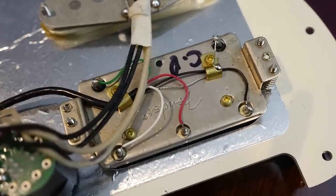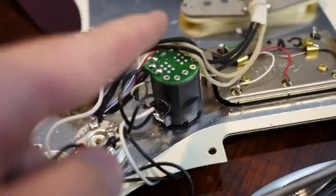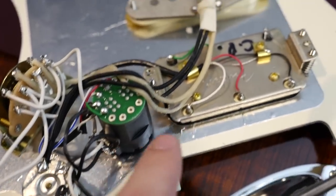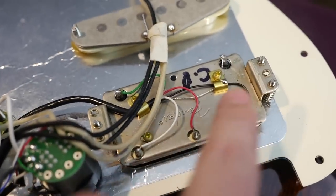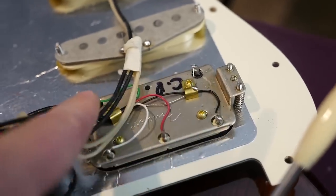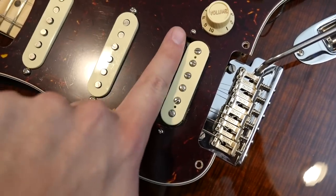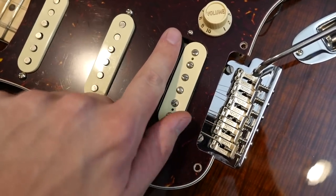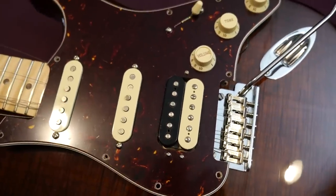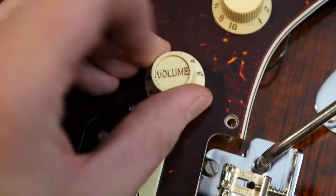Essentially what they've done here is wired this pickup up in a way that has multiple leads coming out. When the S1 switch is not on, this is just acting like a normal humbucker. But when you press it, instead of just splitting the coil in half, they've actually added extra windings somewhere that aren't normally in it. So when it's split, this is actually hotter than it would normally be — like a really hot bridge pickup. To activate that, you just simply press down on the switch.